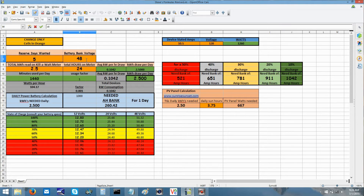Then your battery bank voltage — you can make that 12, 24, 48, 72, 120, whatever you want. Then this is your total kilowatt hours from your kilowatt meter. Some meters will automatically do that over a 24 hour period, in which case you just leave it at 24 hours. If it doesn't, you hit the button that says kilowatt hours and it tells you how many kilowatt hours the device consumed, along with the elapsed time — say 12 hours and 45 minutes. In that case you'd put 12.75 hours, because 45 minutes is three quarters of an hour. Then you hit enter and you'll see all these things in the spreadsheet change automatically.